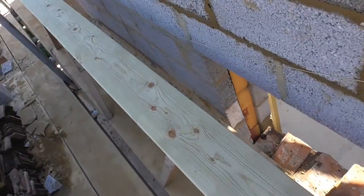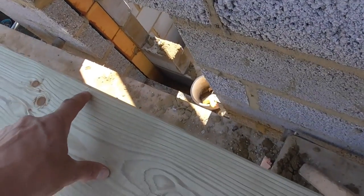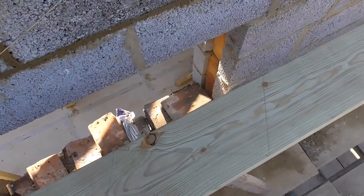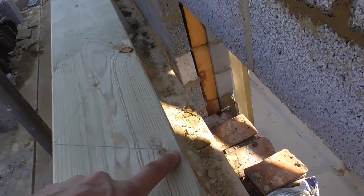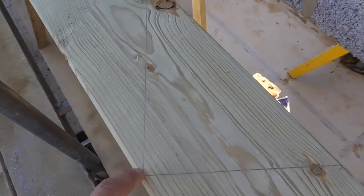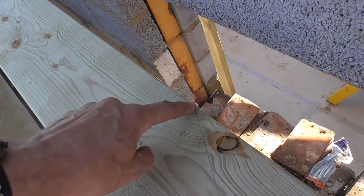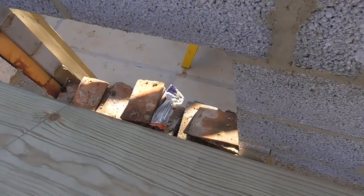So I hope it makes sense - it's using a formula that we all know. Just apply that formula: height above the plate mark there, across the top of the rafter. If you're watching this as a carpenter, you'll be familiar with how we set out these rafters. This mark here would be the length of the rafter if the plates were the same height. We measure half the height difference - 195mm - put a level mark across, and that gives us the length of the short rafter. Then we add on the distance between the short rafter length and where the rafter would be if the plates were the same height, and that gives us the length of the long rafter.